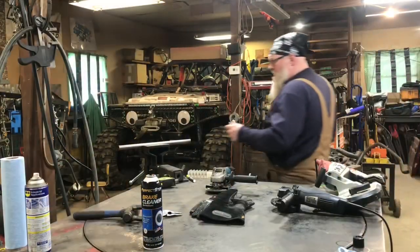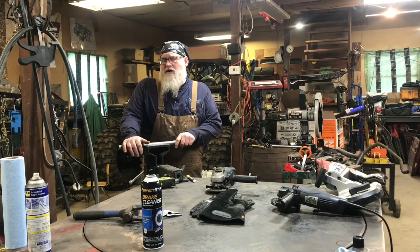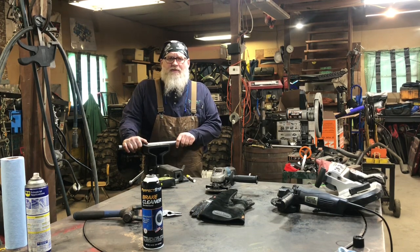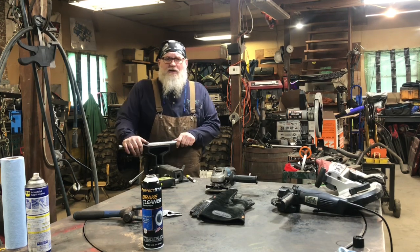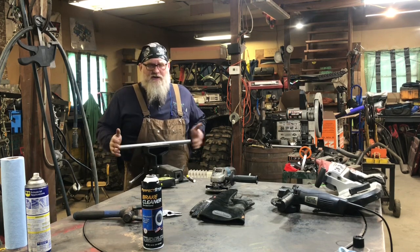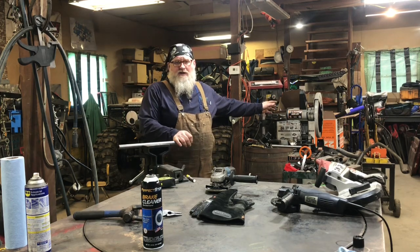All right guys, this first bar here, I took my measurements. It's just under 18, but that's a straight run without any notching. So this 1-inch tube, I allow at least an inch to make my adjustments. So I've cut this stick of tube to 19 inches using this Evolution low-speed chop saw.